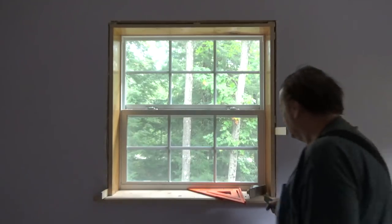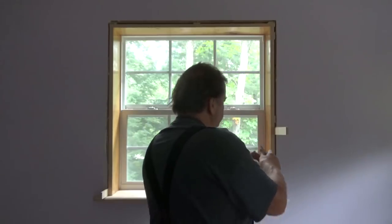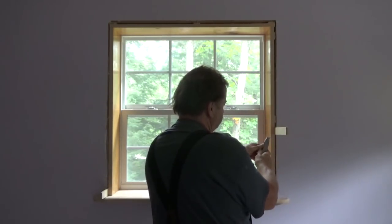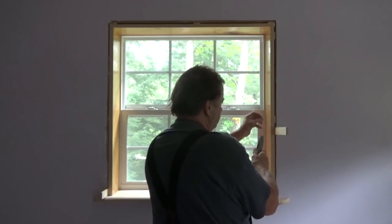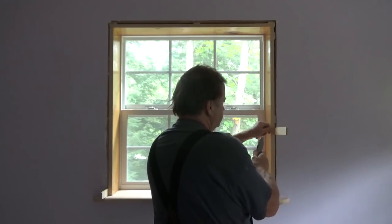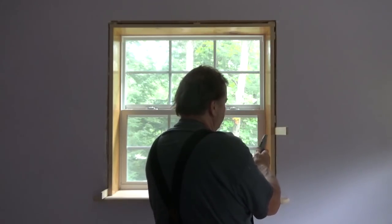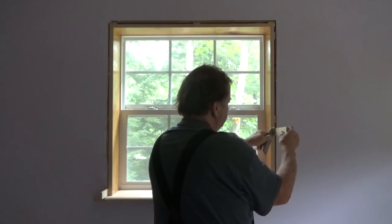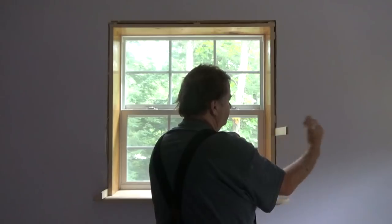What you want to do is cut from this side. Because when you cut from this side, you're going to cut on an angle like this. You're going to cut the shims, and then you're not going to be on the wood if this was something other than wood that you could stain, like white wood or something else that's white that'll stain easy. And you want to keep your hands clean if you can possibly, but even touching your tools puts metallic on them, so you got to be careful. But anyway, what you want to do is come in at an angle, stay right against this board, and cut a bunch of knife cuts. Don't try and break them off.